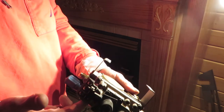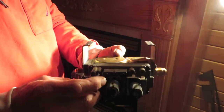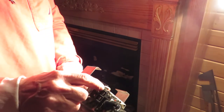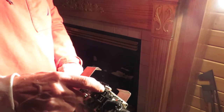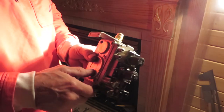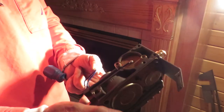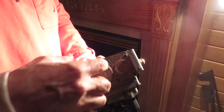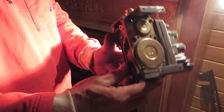Your safety mechanisms include these electrical connectors where the thermocouple and thermopile connect to screws, generating the electricity needed to actually run the valve. You have a winding and a diaphragm running on millivolts — it's essentially a magnet. When it's charged up, it opens and allows the gas to flow through.